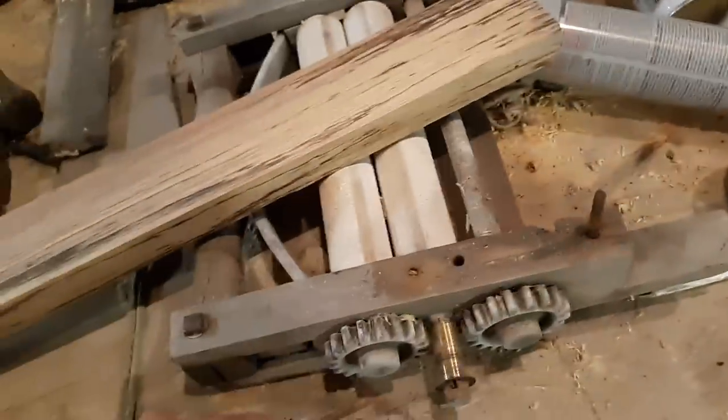Let's get these things drilled. To give you a little bit of an idea about what we were talking about — this is how we drilled it. We drilled a Forstner bit down five-eighths of an inch deep, and then we carried a 19/64th bit on through to the other side here. This nut is made where it would drive down into that wood, and these ears on the nut hold it in the wood from turning. We're hoping we can do this without splitting the wood. This oak is pretty hard — look at that, it tried to burn the sides because I had to cut so slow.